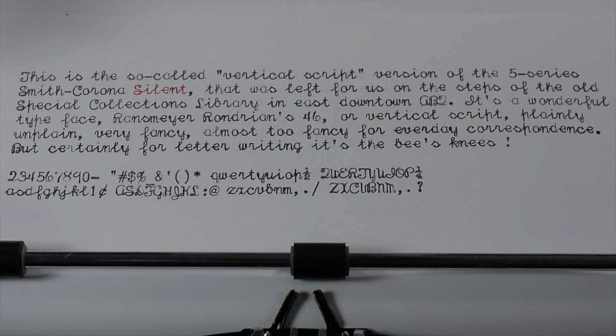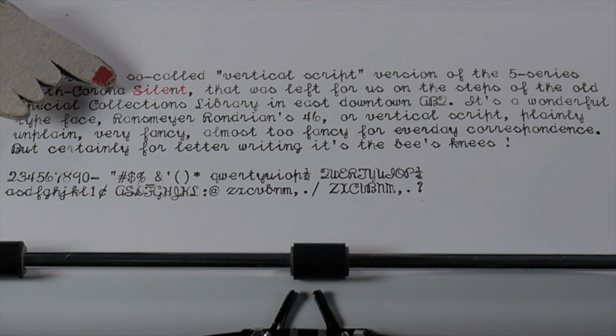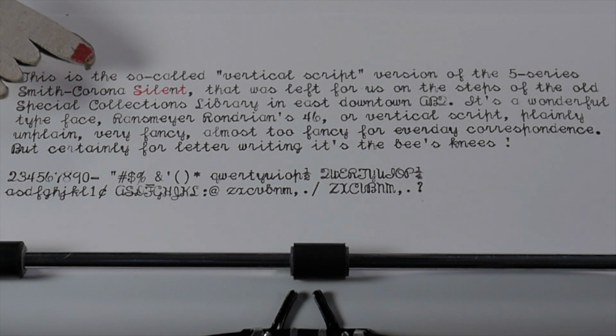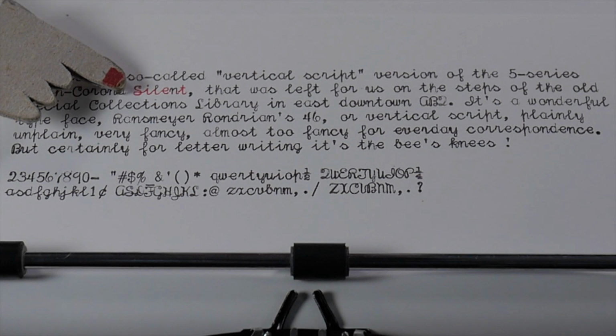And, you know, the machine has a bichrome setting. A lot of script machines didn't permit a bichrome because the letters were often too tall. I did print some letters in red, but there is a little bit of black on some of the letters on the tops of the red there. So either it's not optimal, or often bichrome ribbons aren't manufactured with the dividing line between red and black exactly in the middle, so there's some variation there.